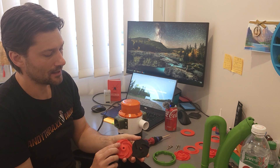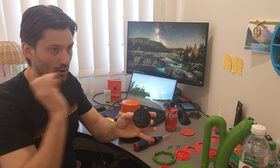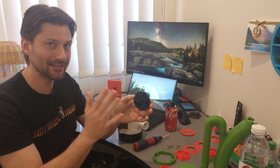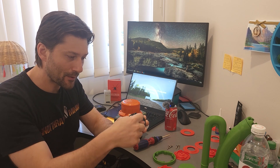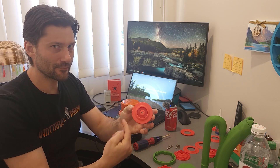I believe the way it's able to achieve that is this being open-face versus this with the shroud — a closed face. When running wide open with just an open hose, you don't really get a ton of extra power with my impeller; they're roughly equal. But as you start to add resistance to the line, water starts to recirculate up the gap at the top of the blades. You have low pressure in the middle and high pressure out here — the high-pressure water tries to go out your jet but also returns up this gap and back to the middle, creating an inefficiency. When you add a shroud, it's a tight fit against the housing, so you get less of that recirculating and more of your energy just goes to pushing water.